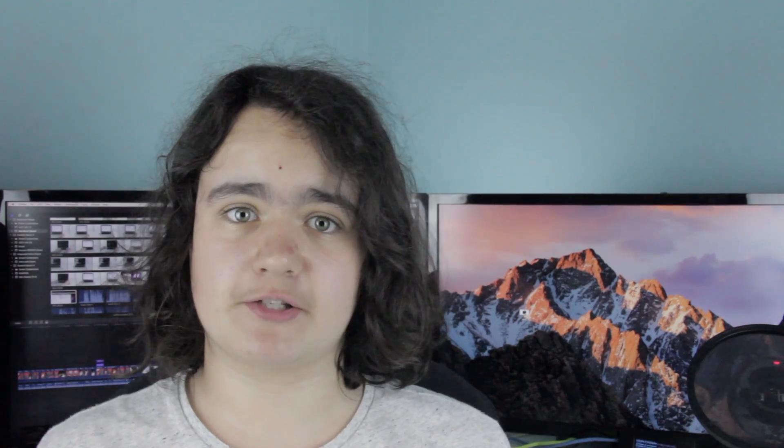Those are the results of my chip replacement on this MacBook's motherboard. If you want to do this repair for yourself, I strongly suggest you watch Louis Rossman's video rather than mine. And if anyone watching this video knows the solution to my SMC problems, or has any ideas, I encourage you to leave them in the comments. I'm probably going to continue looking into this machine myself, but so far everything I've checked with a multimeter and oscilloscope looks like it's doing okay.